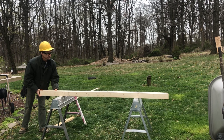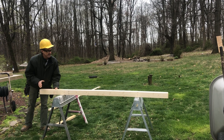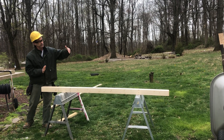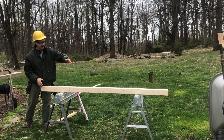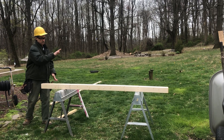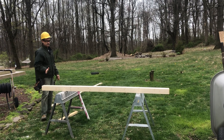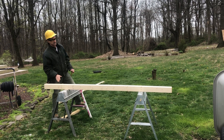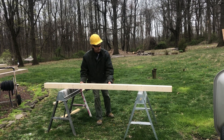When I'm using wall plates they're typically eight foot, ten foot, twelve foot, sixteen feet long so that we can continue our wall if we need to. The other thing we want to do is make sure that we have our crowns up. This is an eight-foot two-by-four. Now that we have them crowned, our plan is to separate them with wall studs.